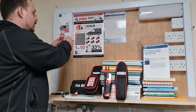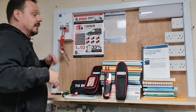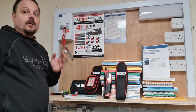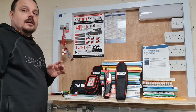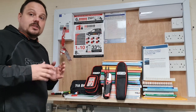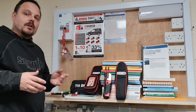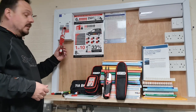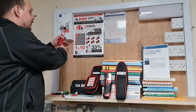You would each have a label and a lock, and you pop it through one of the holes and fasten it — key in your pocket, away you go. The other people who need to be on that procedure apply their own locks and tags with their details on, and when the circuit's ready to be energised everybody's confirmed it's safe to do so. On a bigger commercial premises that's going to be more of a concern; a typical domestic site is likely just going to be yourself and you don't need to go to that trouble.